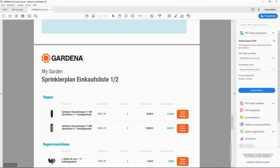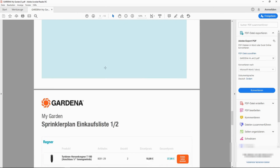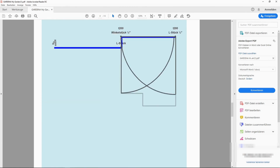So at this one here, or this one here at the corner, the pipe must be placed very precisely, both in angle and where you later want this sprinkler to be positioned, down to the last centimeter and also in depth. And that makes it a bit more complicated. That's why the recommendation is to simply use a standard T-piece that comes from below. Now, here in the picture, something is coming up, and what goes off to the right? The T-piece goes away from here and straight ahead. The ending that comes there closes there.